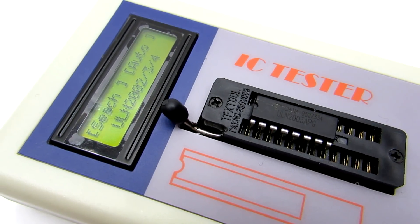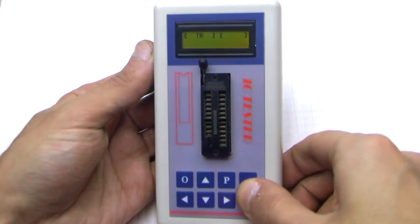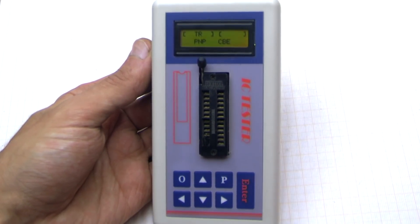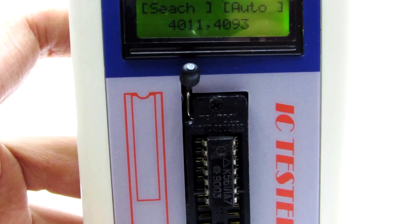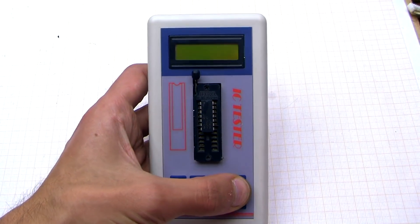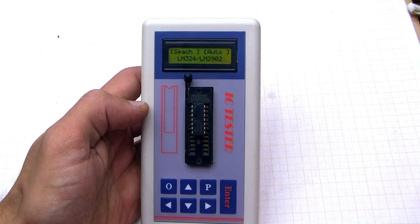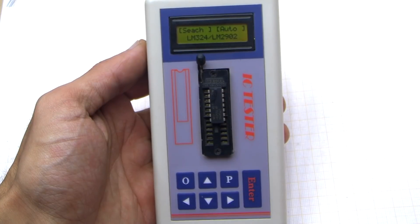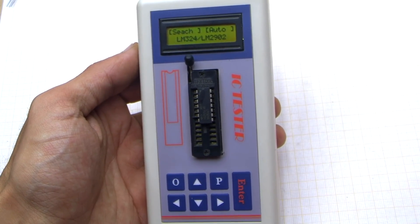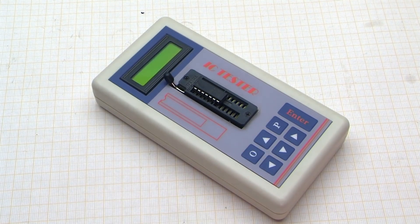Now about the functional — believe me, here it is very big. I will just list the possibilities. An important point is the correct installation of the component; otherwise the device will not be able to detect it. In the case of testing chips, its first pin must be inserted into the upper left terminal of the socket. Then the microchip is clamped and we press the ENTER button. The device will turn on and most likely the display will show an error, but press ENTER again and the component is detected. The type of search is displayed on the top line, the name of the component on the bottom line. The instrument is also equipped with an AUTO-OFF function after 60 seconds, but you can turn off the tester right after the test by pressing the O button.